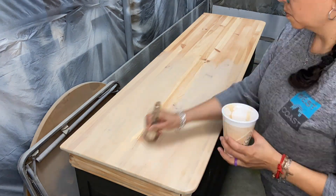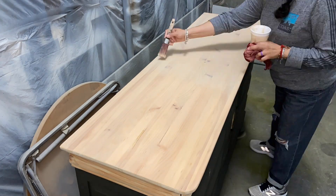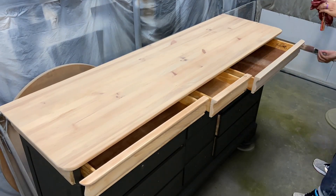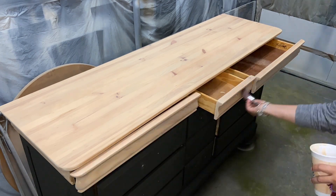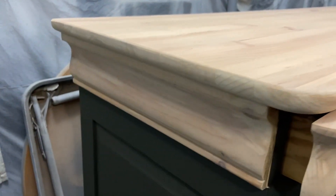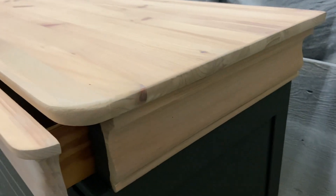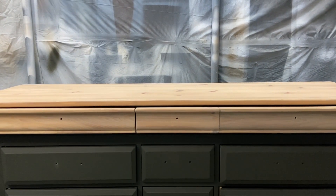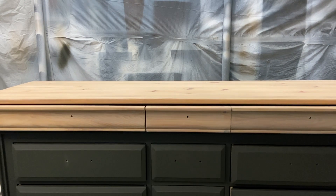These dressers can be pretty large, so I like to basically split them in half and do two halves of the top — that way everything is easier. I do come back and even out the middle when needed by applying an extra coat of the same paint wash. Here's how it looks after one coat — I'm not sure if I need another one, but it's totally even. The pink doesn't show through, especially in this drawer, which was very pink compared to the other two. Now you can see they're even. I'll let this dry and see if it needs a second coat.